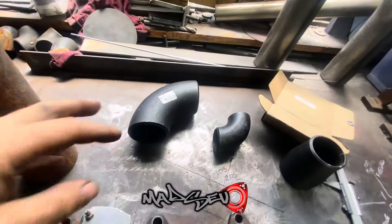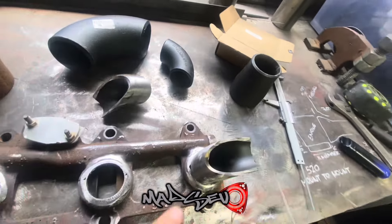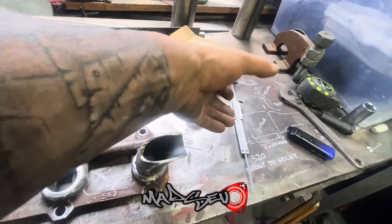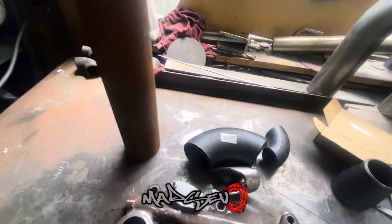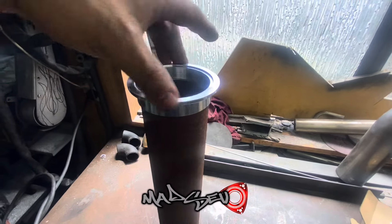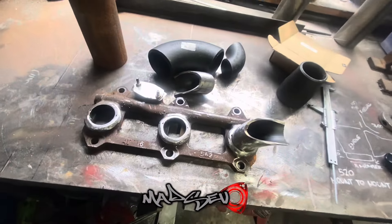It's been a few days now. Picked up what I needed from the steel tube supplier — got all the bends I needed. These were full bends so I'll just clean them up and notch them out on the linisher. I am going to run one tube and collect it up over here with a 90-degree bend, something like that, and we should be good to go. Best thing is this pipe here is a two-and-a-half inch internal diameter, and with my three-inch v-band that fits on there perfectly. So just braze around there and then later on I'll carry on from this point.